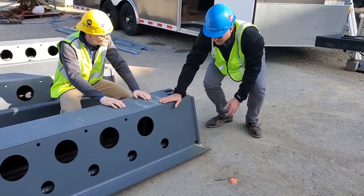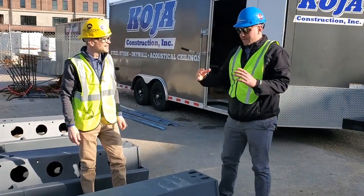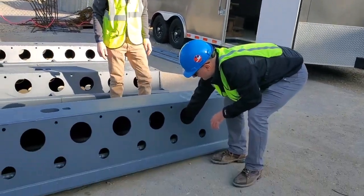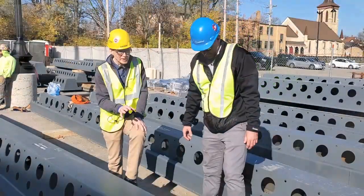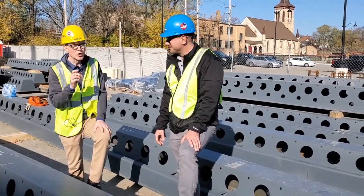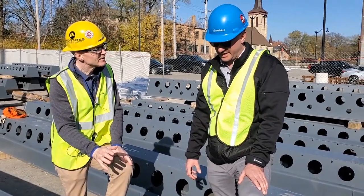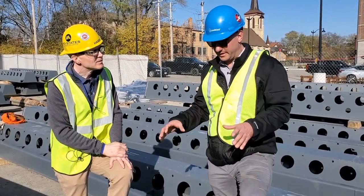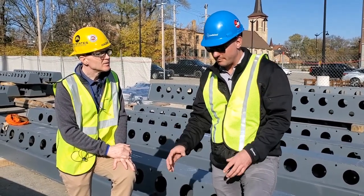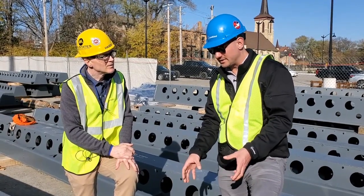Each one of these penetrations is cut with a CNC-controlled plasma table, then set into a jig. There's shop-installed reinforcement in the interior section of the beam. When it comes to fire rating, obviously structures have to take that into consideration and serve the code. Have the beams been UL rated and tested? Yes, absolutely. The delta beam itself is a true composite beam that takes into account both the steel profile on the exterior as well as the concrete in the interior section.